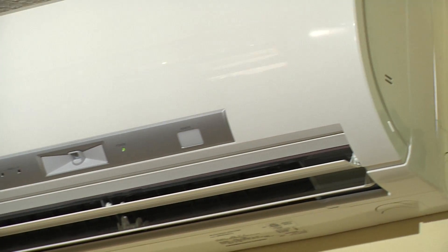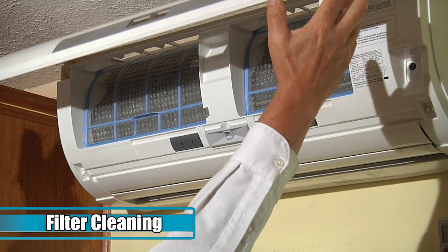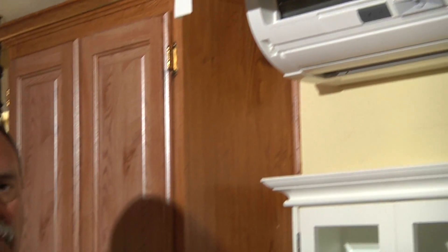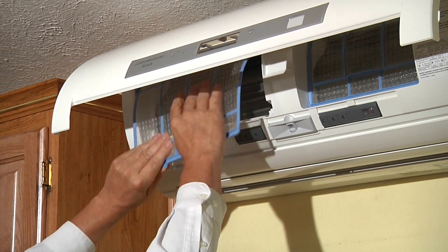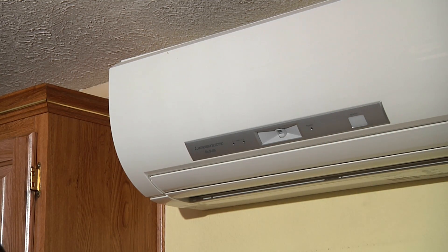Like all heating and cooling equipment that moves air, ductless heat pumps have filters and those filters need regular maintenance. These ductless heat pump filters are lifetime filters and they're easy to clean. All you have to do is lift the hood on the unit. This particular unit has two filters, so make sure you clean both of them. To remove a filter, lift it up slightly and then pull it down. These can go directly in the kitchen sink — wash them, get all the dirt out, then use a paper towel or a quick shake and let it dry out before placing it back. It's easy to slide them back in — just reverse the process. Make sure it's a tight fit and then close the hood until you hear that snap.